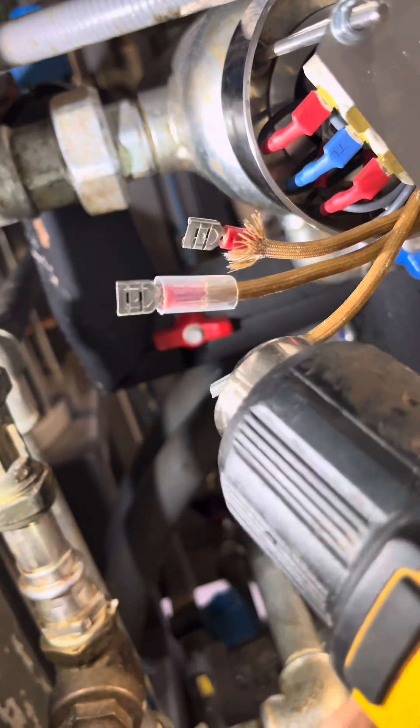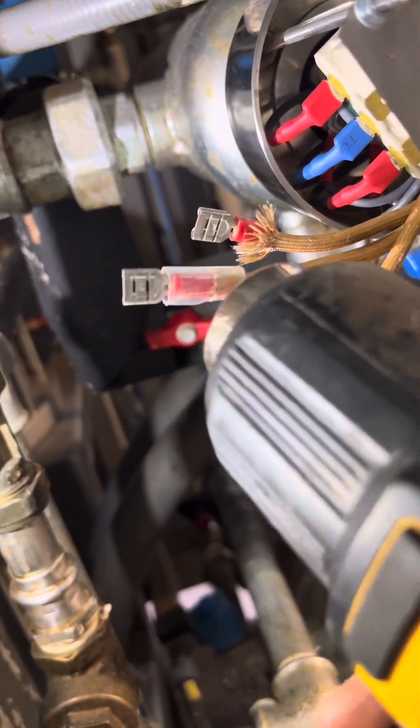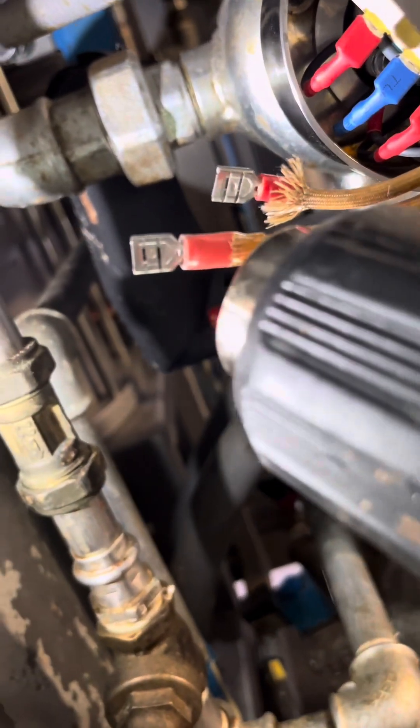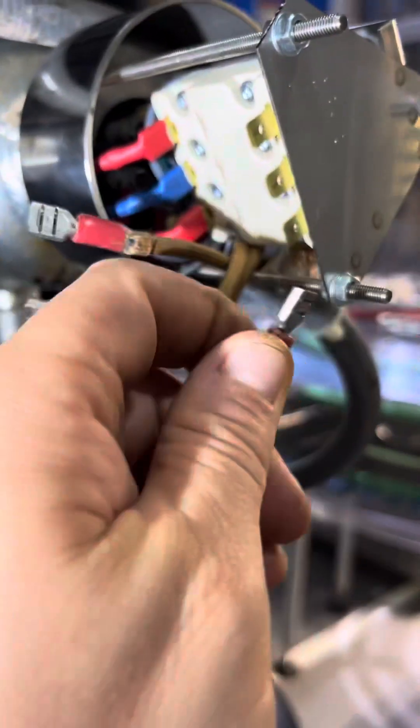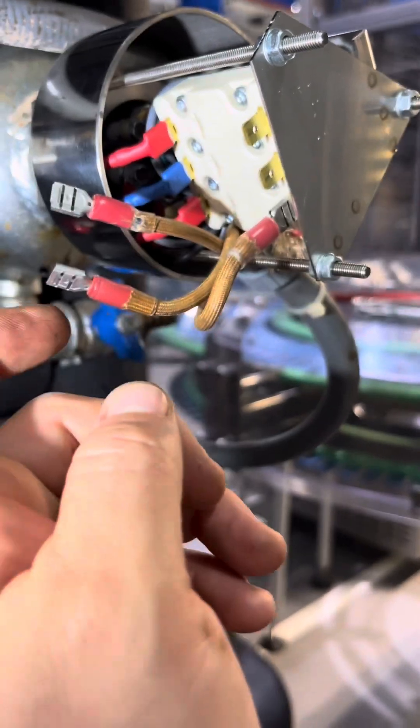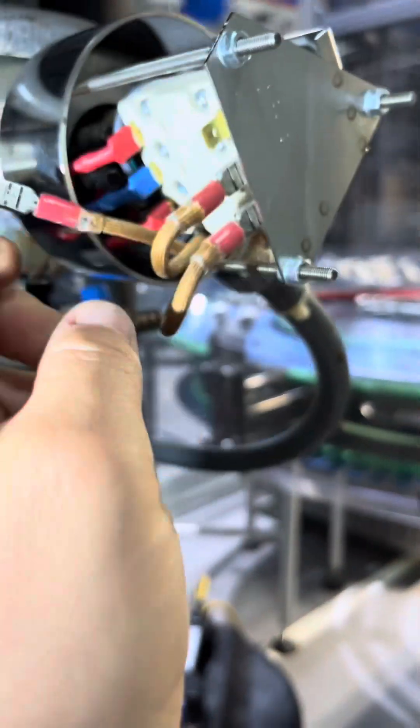We're on the production floor so I've got to keep it clean. I always like to keep everything neat and tidy — don't be that person who just leaves it for the next one. A tiny little bit of heat shrink just makes it look neater. When you're putting it back, you don't really have to worry about the phase rotation because on heaters that doesn't really apply. Just get them in, get them secure, get the right fittings on.